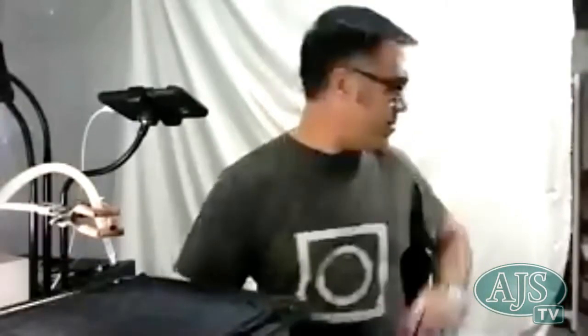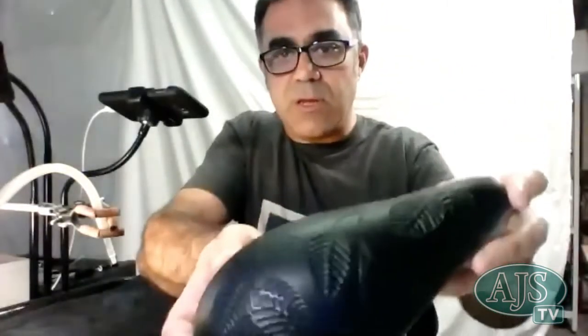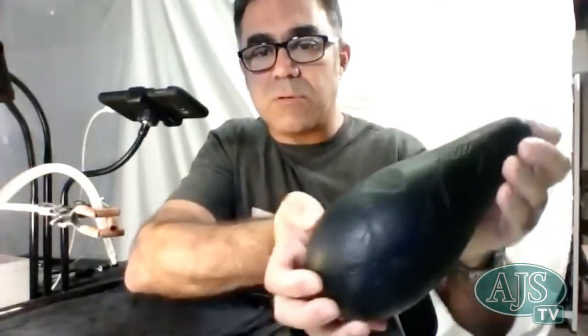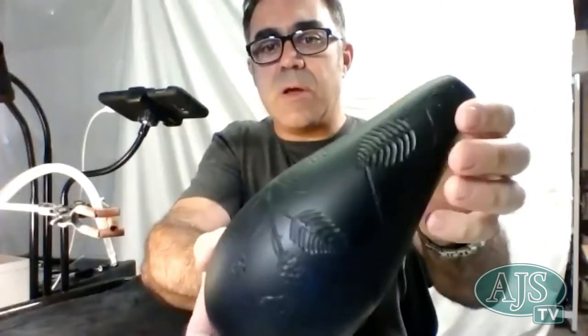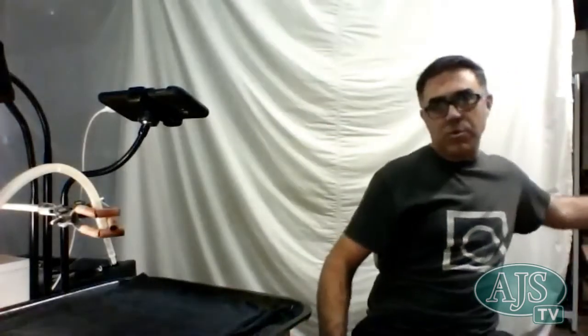This is one of the vessels in the flesh. It's cut twice, basically. The larger, deeper cuts are performed with an engraving wheel, which is akin to traditional crystal cutting, to do the bulk of the cutting. Then I do the finishing, the final work and the polishing, all by hand with a micromotor and diamond burrs and then polishing burrs.